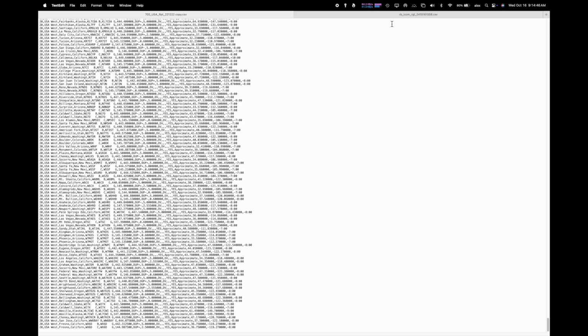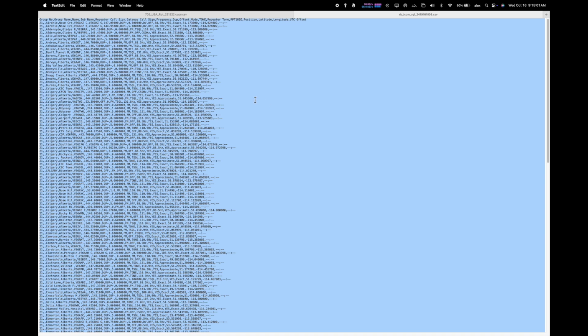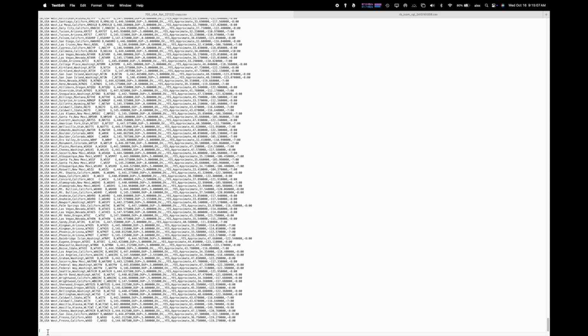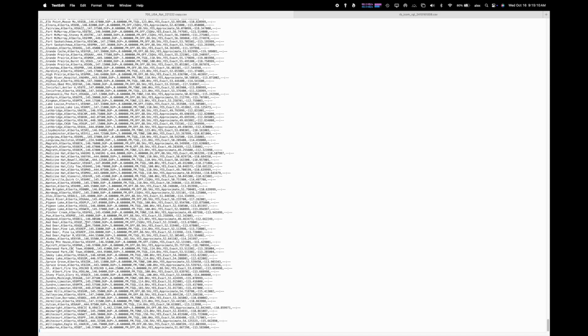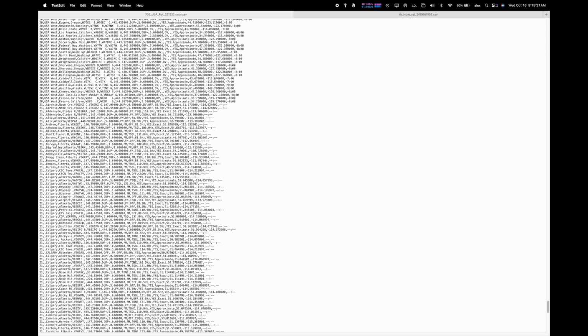Now the file that you created or downloaded from RepeaterBook, this is it right here. And notice it has the number 21 there. Basically, I do a select all, copy, and then I go back to the other file. I'm just going to do a space so it'll be easier to see. And I do a paste. Then I scroll up, get rid of the extra space and that group name. Save. And then you have to place it in a particular folder, which I will show you next.